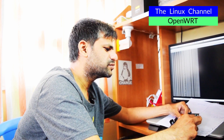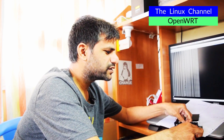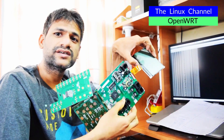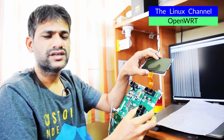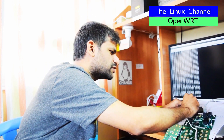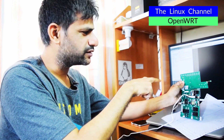Once the LCD is hooked up, it's going to show its boot status and stuff. We can even enable debug messages on the LCD. It's quite an interesting board, although it has very little RAM compared to modern MIPS embedded boards. So I hooked up this LCD. I'll show a bit closer video of the board later. For now, let me just quickly reconnect the Ethernet cable and power cable. While putting things together, something snapped out and now the LED turned up — something in the keypad connection snapped.